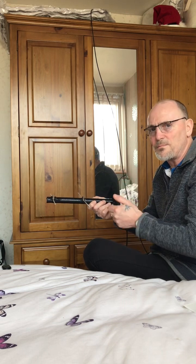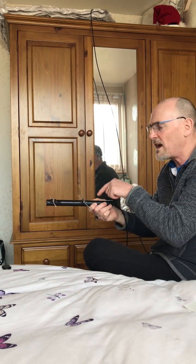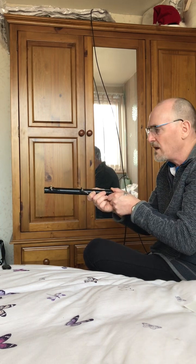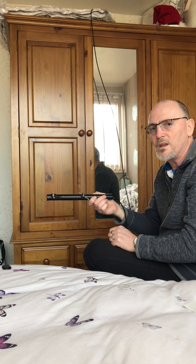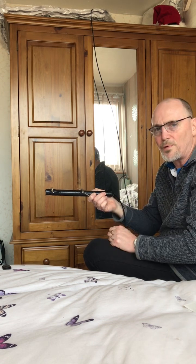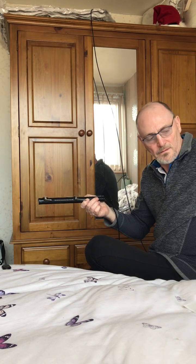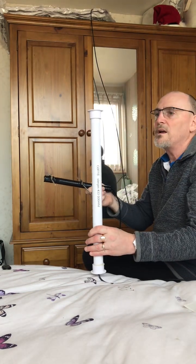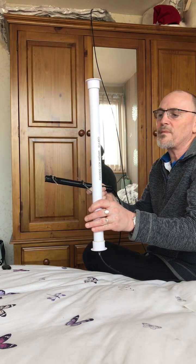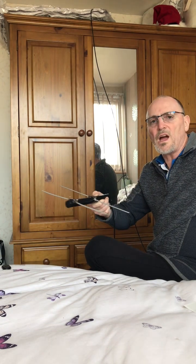If it's going to be later on you're going to buy yourself an all-mode radio with single sideband, then quite possibly you will have a Yagi like this, possibly with more elements, on a rotator, that you can speak to people further away on single sideband who are also horizontal. And at the top of your rotator pole you'll probably have a white stick antenna, so that when you're speaking to people on FM, you can speak to them on this vertical. And when you want to speak on single sideband, you'd be using your Yagi.